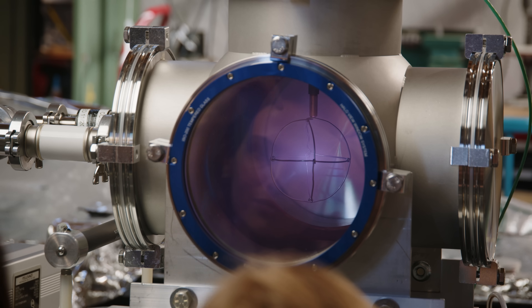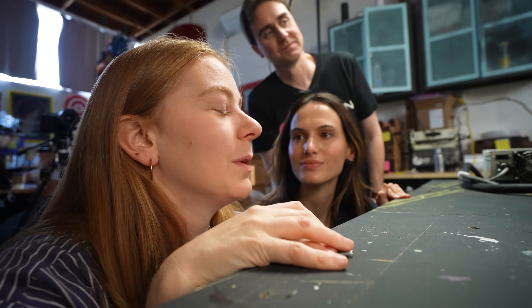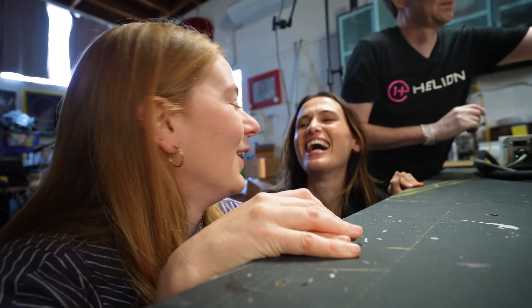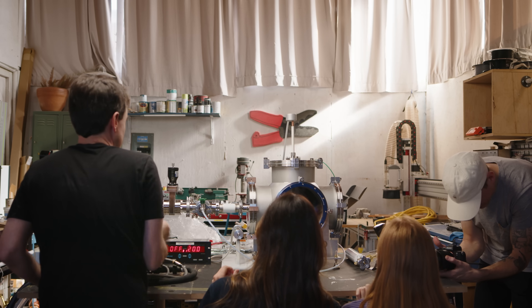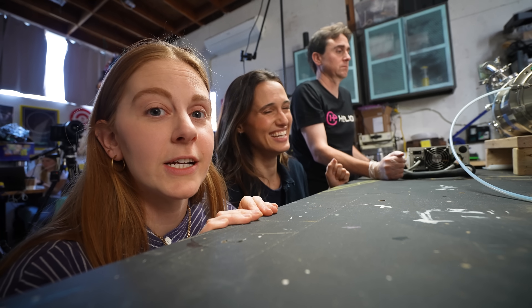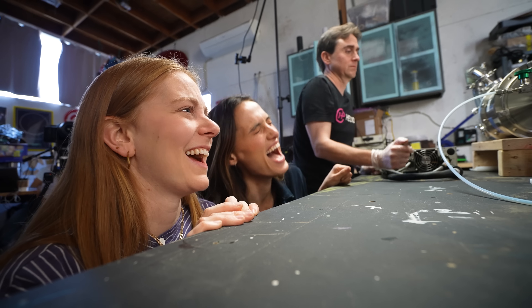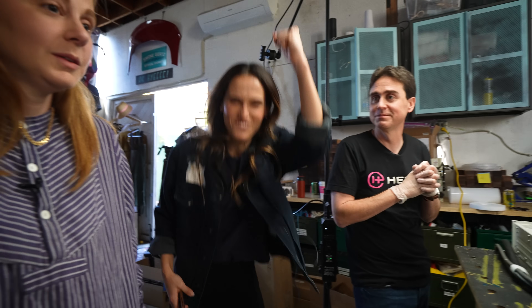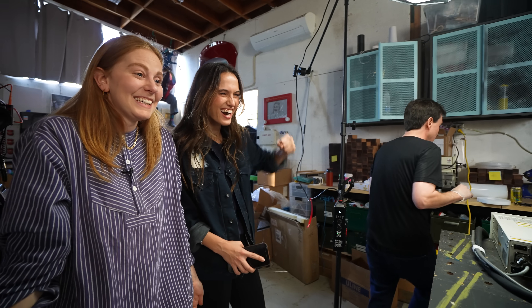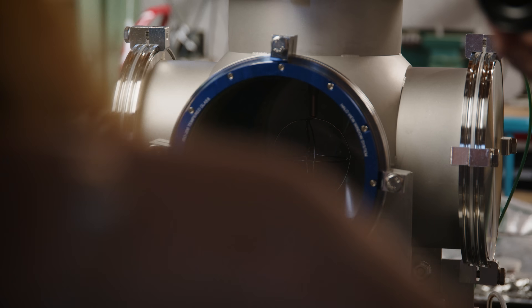Now it's starting to run out of gas — there's not enough ions around to drag in and collide. Eventually the gas will decay enough that there won't be enough to even sustain a plasma at all. Can we say we did fusion? Yes you can say that! We did fusion — at that accelerating voltage in pure deuterium, at this pressure, there was fusion. In my workshop. We did fusion in Simone's workshop!